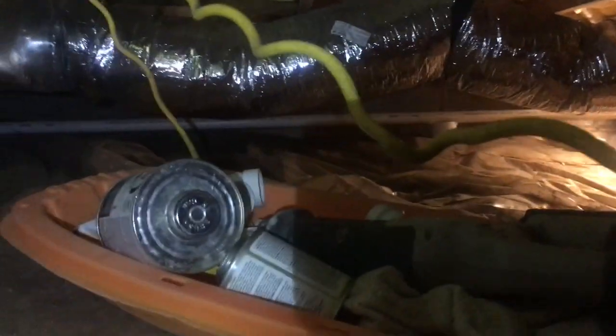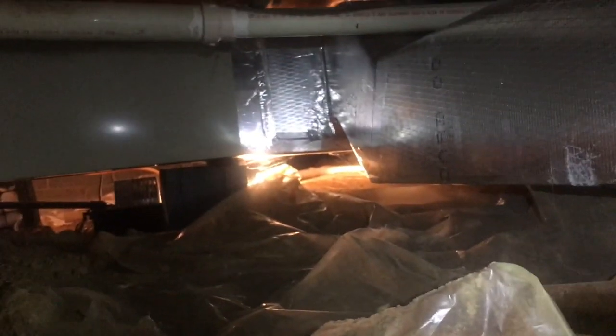Now I need to get back under that house and put some plastic down. We've completed attaching the inch-and-a-half pipe off the main stack and routed it through multiple suction points throughout the crawl space. Got my trusty sled here — moves all my stuff around while I slither like a snake. Now we're going to put down the plastic underlayment.